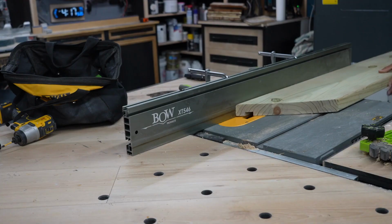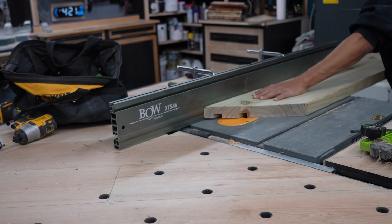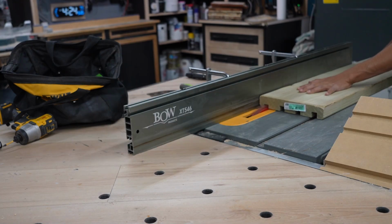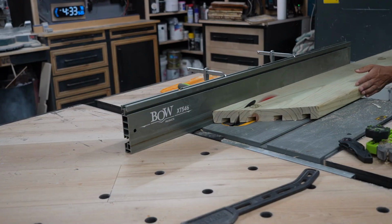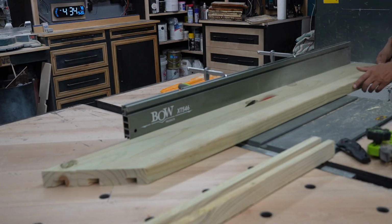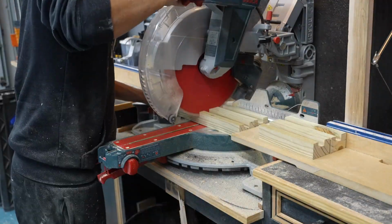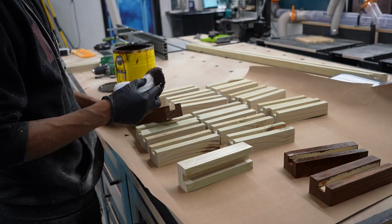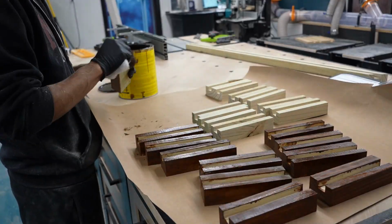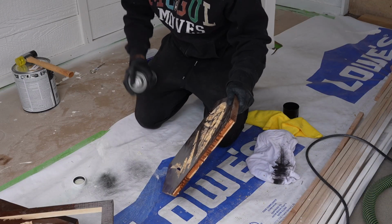Ideally, I would have had the panels built into the trim boards I added to the railing already, but I really couldn't conceptualize how to do that effectively, while still making sure that the trim boards lined up to the railing nice and tight the way I put them in already. So the best alternative I could come up with to mount these panels into the railing was to make these mounting blocks with a groove down the middle. And so I planned on just screwing these into the railing boards and then sliding the panels into place and nailing them off to secure them in their final position.